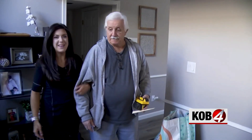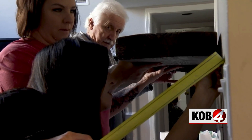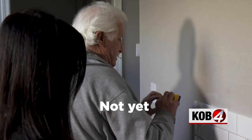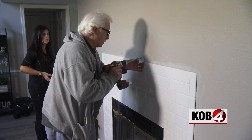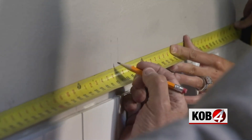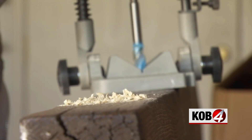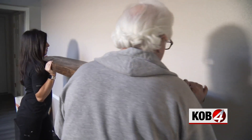This DIY is a family affair — I brought my dad in to help us install this three-inch-thick hunk of wood. This mantle was made by my father-in-law. He wanted to find the studs on the wall first and drill some holes for steel rods, because the mantle will be floating with no brackets. We transferred those measurements and drilled them out, then he put the steel rods in those holes and we pushed the mantle onto the rods pre-drilled in the wall.